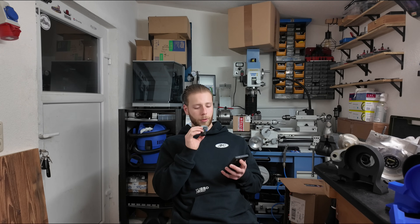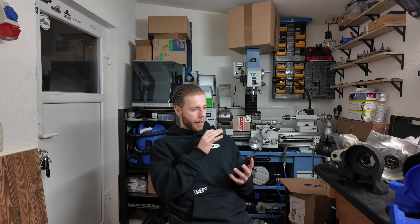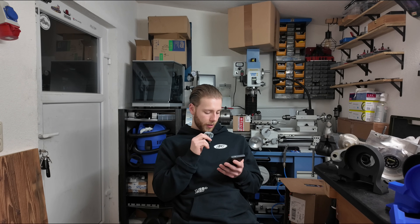Now I'm getting two new Zabel ZM30 cylinders with a 104mm bore, matching forged custom pistons, and two crankshafts with a 91mm stroke — a total of 1546cc two-stroke. But I'm waiting to make the official announcement until I have the parts in my hands. So I can redo everything you see here. I'll get a Zabel ZM30 cylinder and crankcase half for now to develop the final crankcase until my cylinders are finished.